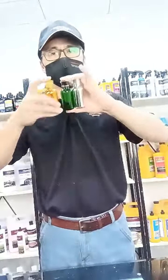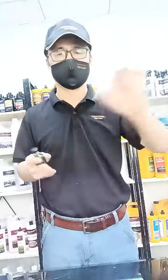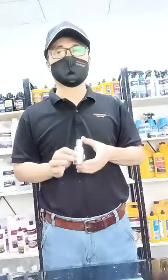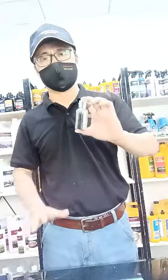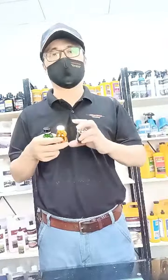So we give the idea of different dilutions, maybe 50% diluted, 30% diluted, and 70% diluted. For example, with 50%, that means the original material is only 15 milliliters of this gel, giving 15 micrometer on the coatings. For the 70%, maybe 20 micrometer thickness, and this one for the original is 30. So that is what I explained for the separate coating. If you want some examples, it's okay.